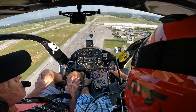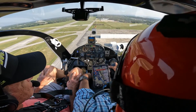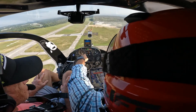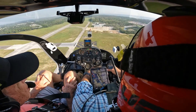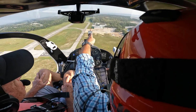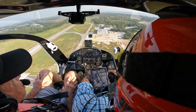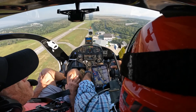Away we go. In the climb, I'm setting about 35 inches of manifold pressure with the collective lever. I'm using the cyclic to pitch for 65 miles per hour — forward and aft cyclic as required. The pedals maintain the aircraft in trim. Left pedal — the yaw string is red on black, we're in trim for the most part. Now everything is basically on the cyclic.